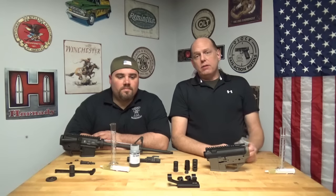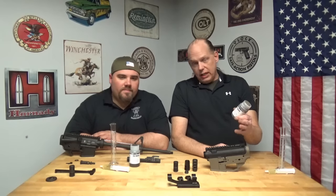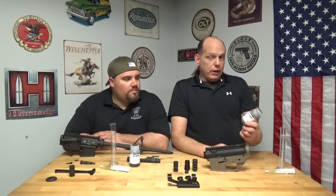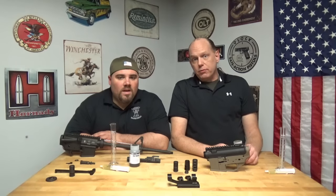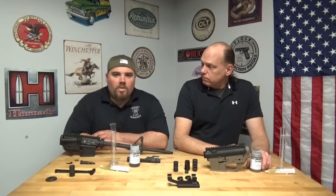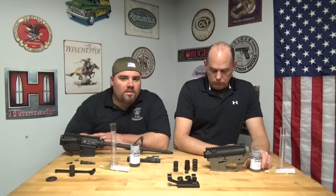Absolutely. And you have two choices. You can use a bake on, which is what we're going to be doing, if you got access to an oven. This is the H-Series. And there's also an air dry, which, if you don't have an oven, might be a great option for you. It's also great for scopes and polymers. We have done polymer handguns before, and it's worked out just fine. You just got to cure it at a lower temperature.